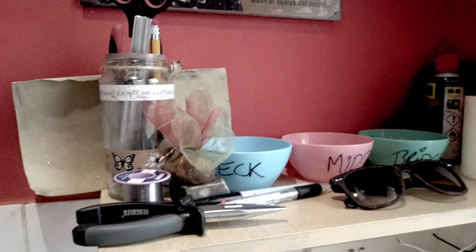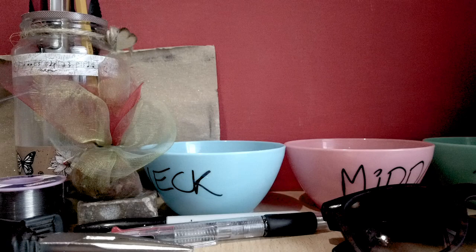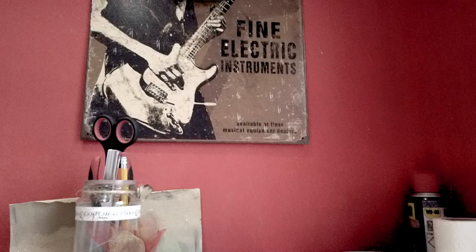So some of you who've got my Big Iron low wind pickups will know they're low wind, but they're not thin sounding. And they're not thin sounding because of the coil capacitance. Because my wind's different, there's something different in that wind, and I'm altering the coil capacitance. So I'm still putting a bit of body in. There's always a bit of body in that pickup, even though it's a so-called low output. Yeah, definitely. And it remains solid under load.